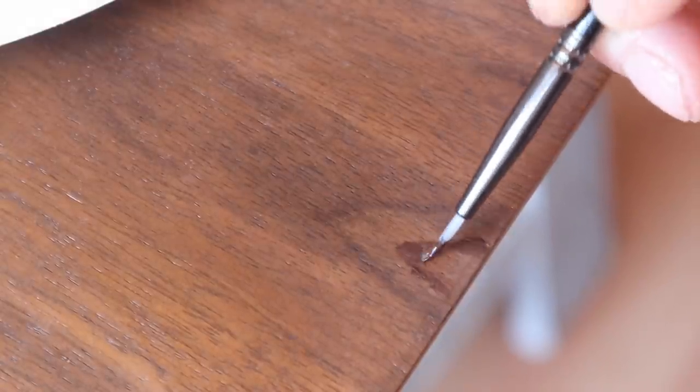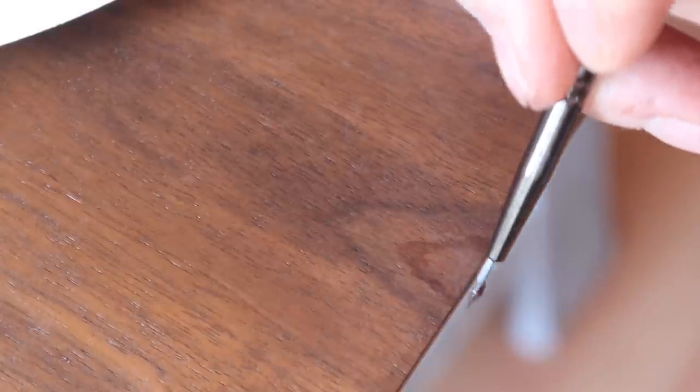That's where I filled that veneer that was missing. So I am just going to paint a wood grain on here, and I'm taking my finger so I can lighten it up a little bit. But there are areas where it's darker. And then I'm gonna allow it to completely dry and put my second coat of the Wise Owl 1 Hour Enamel on there. And then it is going to all just go together. And if you didn't know it was there, you wouldn't know.